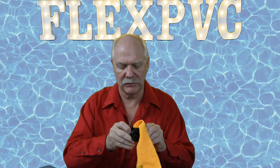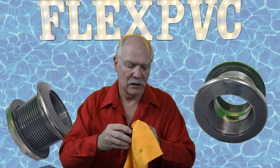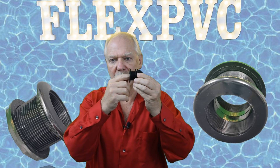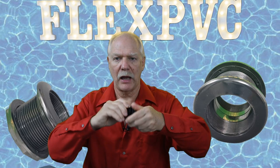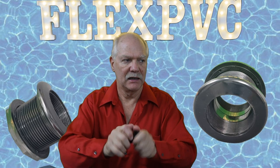Okay, bulkhead fitting — this is a bulkhead fitting. It's a dirty one, excuse me. Basically, a bulkhead fitting is a hollow bolt. You can see through it, and the idea is you put a pipe in here, pipe in here, or you could put a nipple in here, or any sort of fitting on this side. It's a hollow bolt, which means you cut a hole through a bulkhead — the wall of a tank, an aquarium, a cooler, or whatever. And it comes apart.